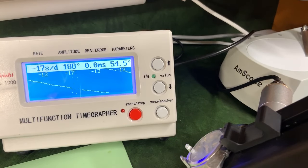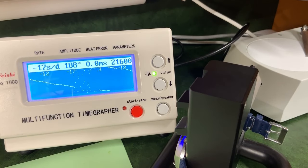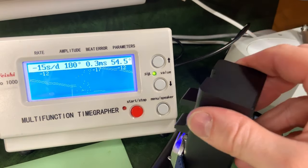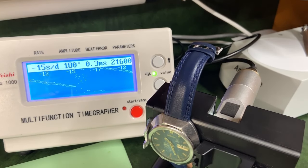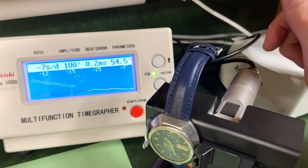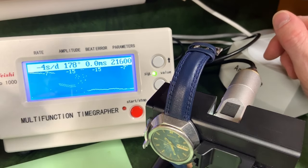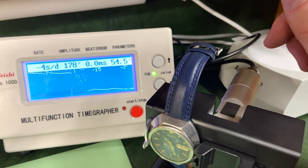We'll just change position. So we've just got it down on the side like that now, and we'll give it a minute to catch up with itself. These things always take a little while to catch up, and as you can see, a slight beat error, which you would expect — fairly minimal. But the rate has stayed pretty constant from that particular movement. We'll turn it again. So often these are the positions that can start to stress the balance with a bit of gravity, and also if there's anything slightly out of alignment or you've got a lot of end shake, this is where it'll tend to show. I'm very happy that already in three positions we're pretty much constant. We're losing a few — we've lost a little bit of amplitude, but we've actually gained accuracy now. So it's pretty good.